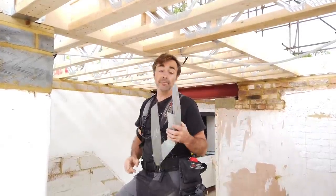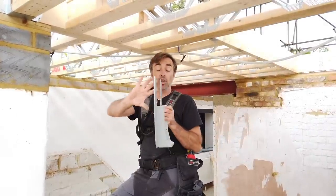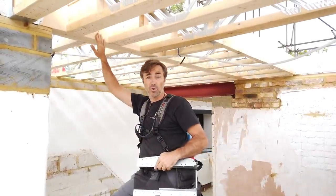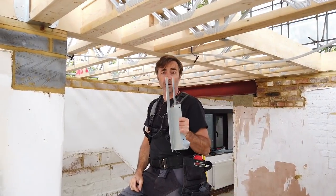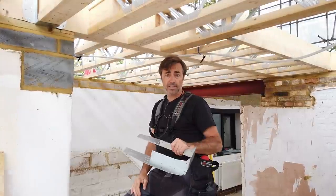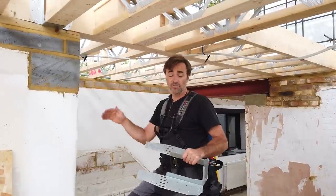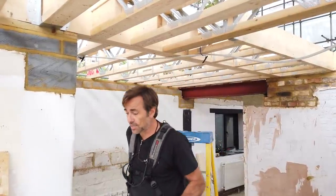Here we've got a three-ply beam and we've got these big hangers. A lot of the strength comes from what they call the wrap — that's the top wrapping over. This three-ply beam is in my floor, which means if I don't let these in over the top, when I put my 22mm EGP board over the top it's going to want to form a hump, no matter how much decking adhesive you put on the adjacent joists.